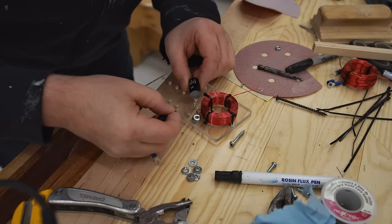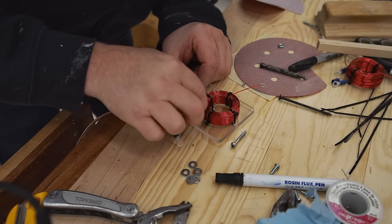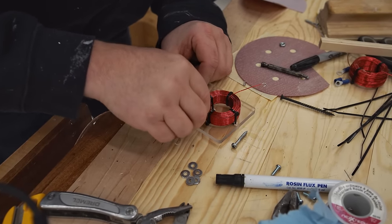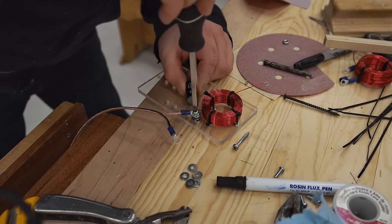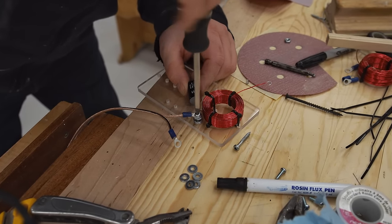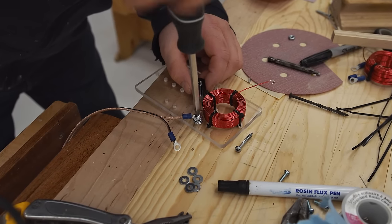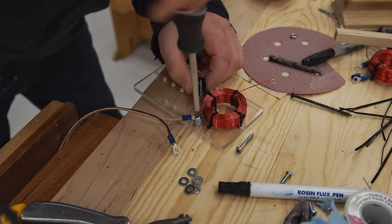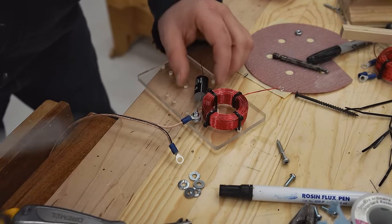And even though building a board like this makes it look organized and pretty, I will admit that it's harder than it really needs to be, especially using these homemade screw terminals that I have here. It's more than a little bit tricky to line up all the parts and hold them in place while driving the screw at the same time, but it does get easier with practice, and I do eventually get better at it just when the project is all done.